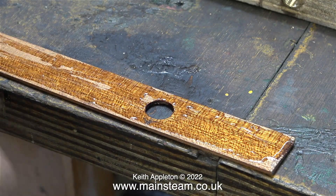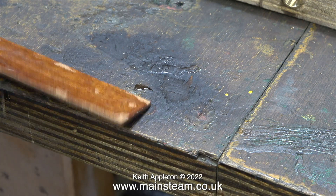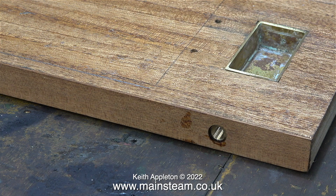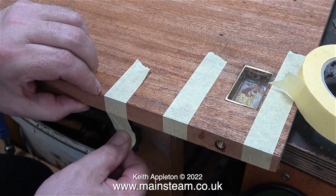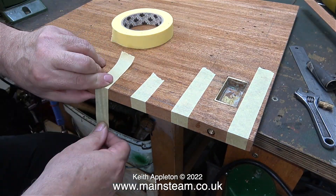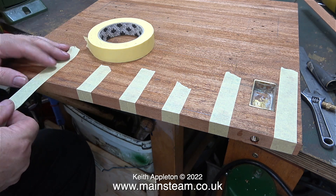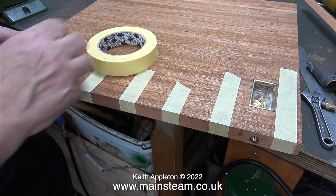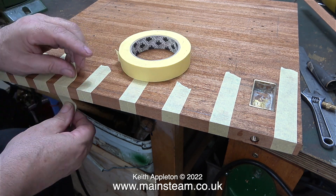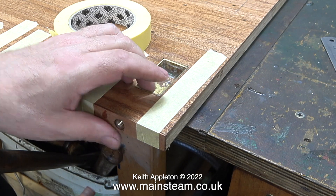Now it's time to get the superglue out. This is cyanoacrylate adhesive, or CA glue — the medium viscosity type. What you've just seen me do is thoroughly coat the piece of mahogany, and I've carefully pressed it into position on the edge of the baseboard. To make sure I have full contact between the cyanoacrylate adhesive and the edge of the wood, I'm using masking tape to pull it tightly into position. You can't hang around when you're doing this job because the superglue really does set quickly. The video, by the way, is running at twice normal speed. After the first pieces of masking tape were in place I filled in the gaps with some more. After a quick adjustment using the drum sander, it's perfect — one down and three to go.